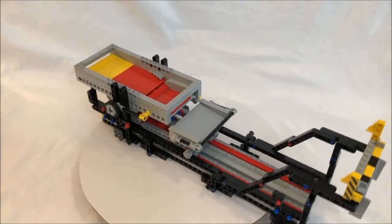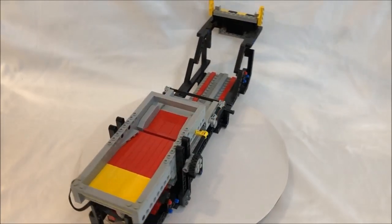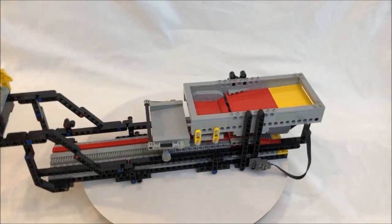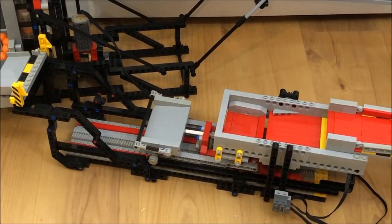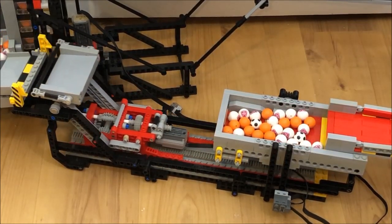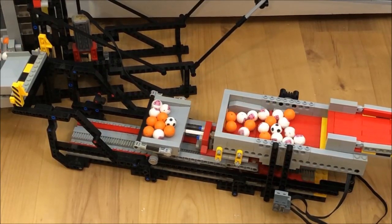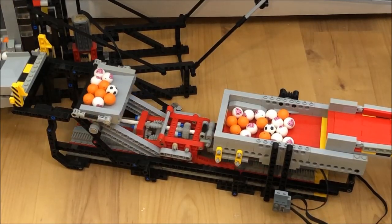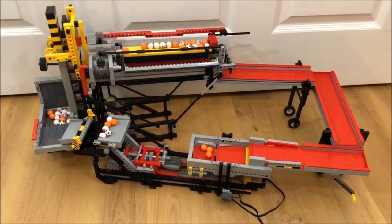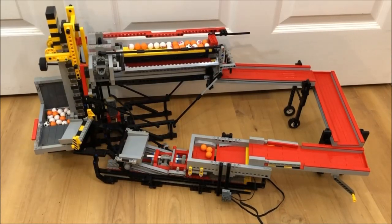The mechanical reverser mover uses just that mechanism to transport balls horizontally and vertically. The rest of the modules, including this one and the 10x10 stepper, all handle 30-ball batches fine, and I subsequently need to rank them by other factors. Especially after sitting for a while, the mover doesn't seem to have the best reliability, and the motor wire still gets caught without some finagling, preventing this module from ranking any higher.